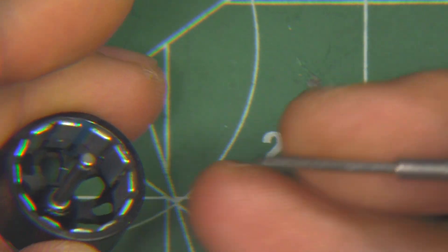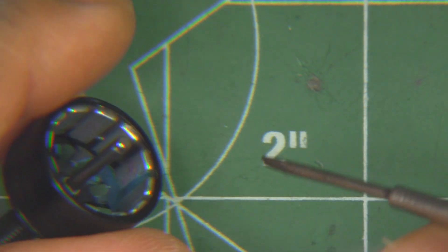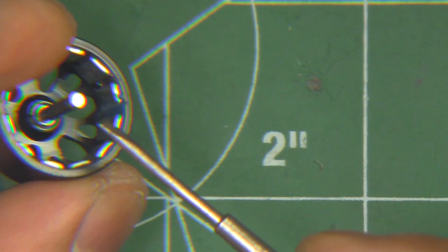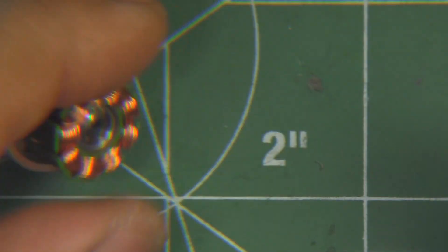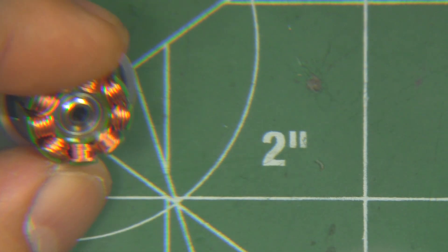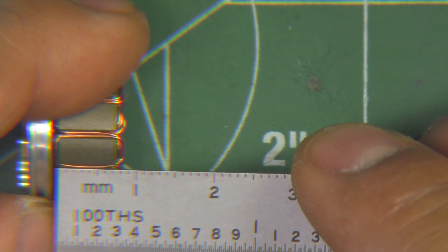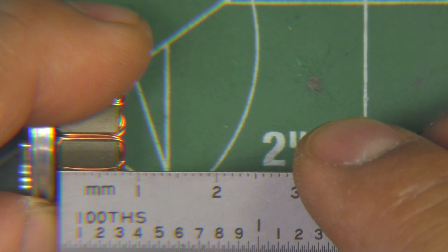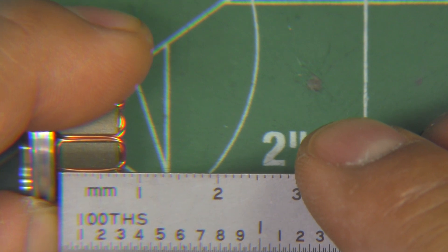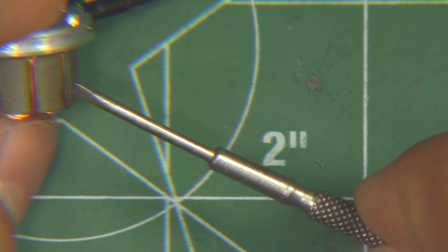There's a good amount of epoxy on the magnets, so those are not coming off. These 1407s usually don't suffer from magnets coming off anyway — I've never seen any reports of that. The shaft is 2 millimeters. There's the stator: single-strand wire, looks pretty neat, pretty good packaging on the windings. The stator height measures 7mm as specced — no surprises there, so it is a 1407. The lamination is 0.2 millimeters, which is pretty much standard in all motors these days.